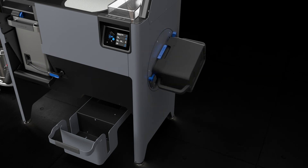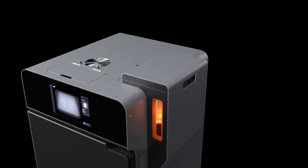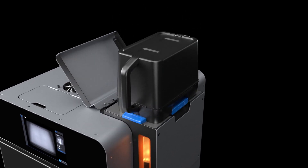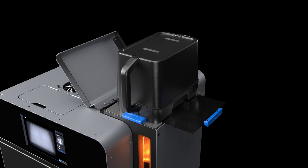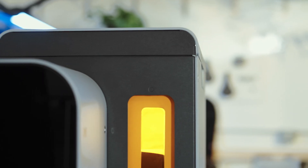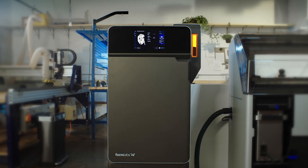When the cartridge is thoroughly mixed, it is used to refill the FUSE powder hopper by inserting the cartridge valve into the hopper and pulling the valve knife to allow the powder to fall into the hopper. The cartridge will keep any powder from migrating out of the hopper, so it's best to leave it in place for a few moments as the powder plume settles. We've now returned to the beginning of the powder lifecycle and are ready for the next print.